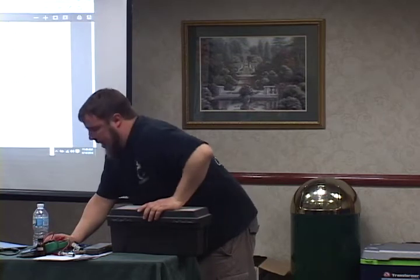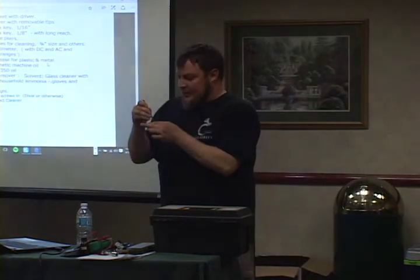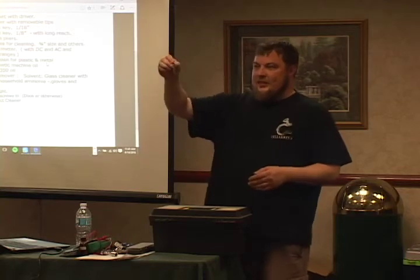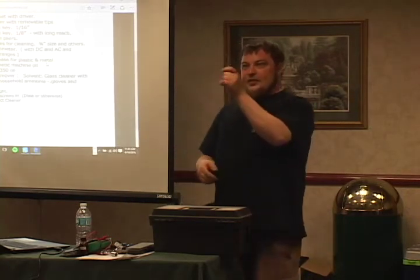I think that's it for that. There's a few parts that you'll end up finding out later on that they're not normal maintenance tools, but you'll find they end up working great, and you're like, I need that. This is like a weird little dentist tool. But look, this is amazing for putting F and G belts on, the servo belts, and the B pulley type deal, the B guides. This is an amazing tool. It helps out a lot, more than you'd imagine. Even for just reaching in somewhere and grabbing the screw you dropped. These have helped me out a lot too.